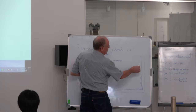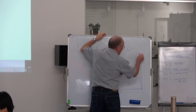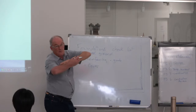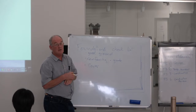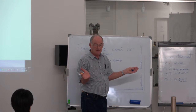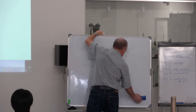And the same with, you've got a joint in the middle. So you've got a joint in the middle, and this rod here joins that rod, and that one goes through there, and that one stops there, and they're tied together. That lap, the overlapping of that, the building inspector will want to measure. And if it's not the minimum requirement, you can have it more, you can have a 600 lap, but if it's less than 480, he's going to knock you back. He's going to say, do it all again, fellas. So, cover and placement.